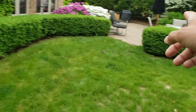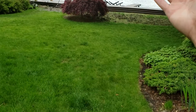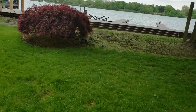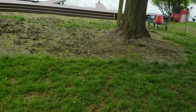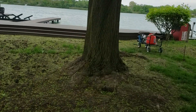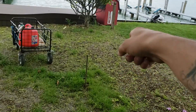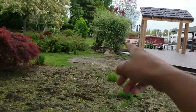These are the boxwoods that need to be trimmed. They want to push the grade that way because they're having water come up and over, so you might have to move some dirt around. Make the circles around the trees — make a circle around that tree. We're sodding all the way up to the deck. Bring this area down right here, move it over into the grade and get it graded. Same thing with that over there.